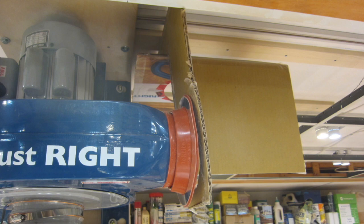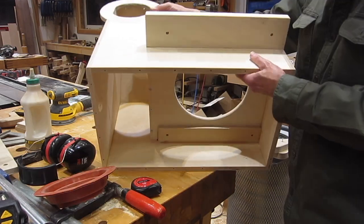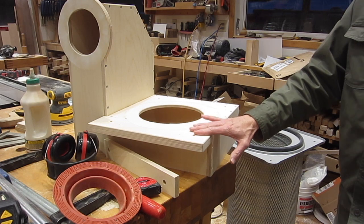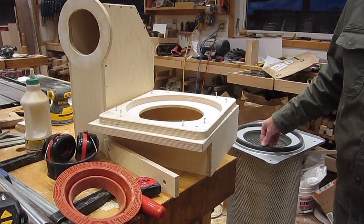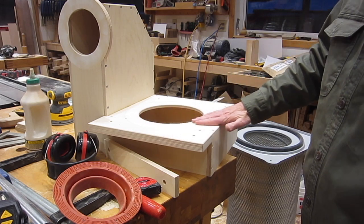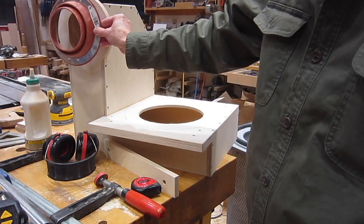It was hard to design this box on paper, so I made cardboard prototypes until I got something that would work. The box holds the filter and connects it to the blower — exit air from the blower comes in here, through there, and down into the filter. The filter has a rubber gasket, so I made spacers that allow the metal part of the filter to bear down and compress the gasket by about an eighth of an inch. I won't glue the spacers in case the next replacement filter is a little different. On the surface I spread a very thin layer of silicone caulking using a plaster spreader. A tip: if the silicone is sticking to the spatula, dip it in soapy water first and you can smooth it out nicely.